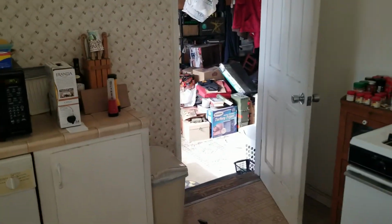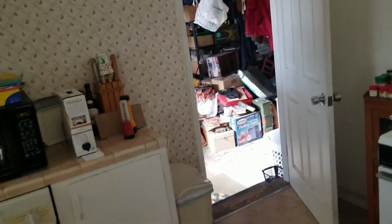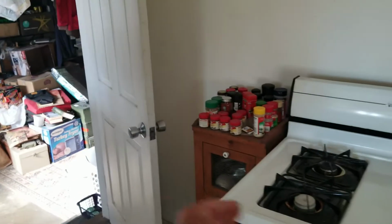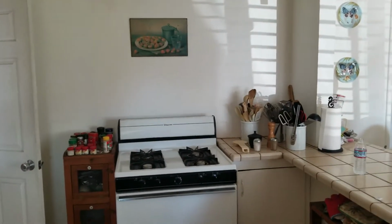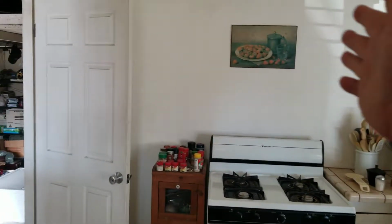The question will be how far we bring the lowers and the uppers, because if they're brought all the way over here, depending on how far this stuff comes over, it starts making a very narrow opening. On this wall, the concept is to get the fridge, likely counter depth, and maybe alongside it, depending on how we position it, a pantry. Where Deb is standing, we want to keep the island, with lowers down here, and this is going to be a breakfast bar. We're going to go up 4 inches with a 12 to 13 inch breakfast bar.